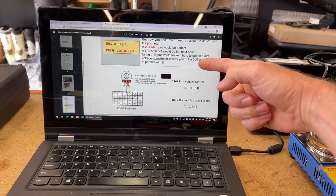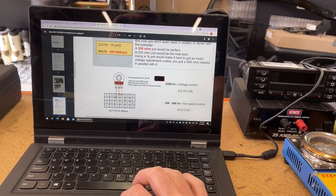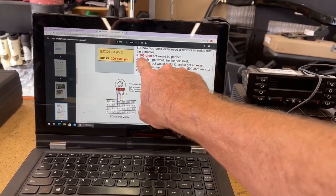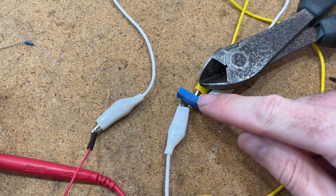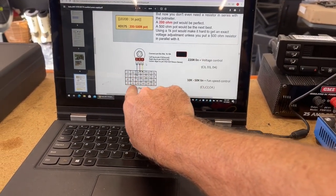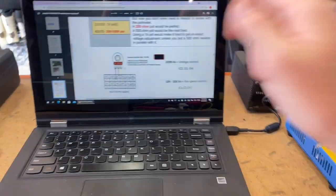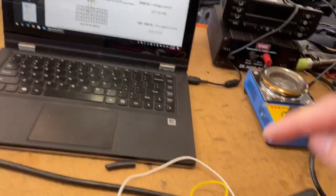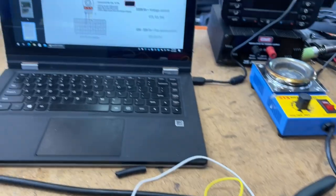So this is the PDF. This PDF is actually listed on one of the BMW forums as well, and I'll try and put a link to it in the description. This is basically how I've worked out what I wanted to do. The first part of the process: I'm going to run a 500 ohm pot — well, I'm using a trim pot, but it's 501 — so I've got a 500 ohm pot in between these three pins. This little pin matrix is just here. I've connected my trim pot to D3, D4, and C3 as per this document, and as I adjust it, clockwise gives me more voltage, anticlockwise turns the voltage down. It's that simple.